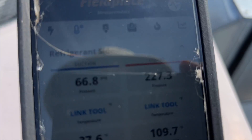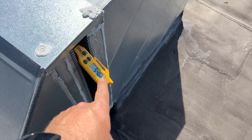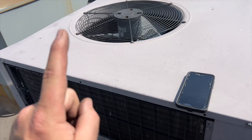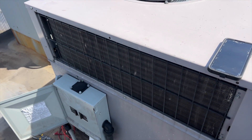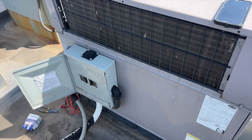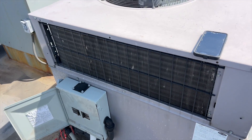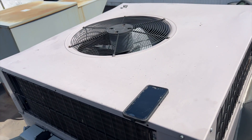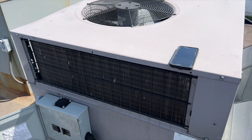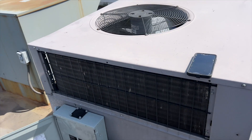She's been running for a little while — here's what our pressures are looking like. It's not freezing, so that's good. Discharge temperature is about 54 degrees, so it's definitely back up and running. I would like to do a more thorough coil clean and clean that blower assembly and wheel, but it is what it is. We've got new filters in and she's doing pretty good. I'm still not sure what caused the low-voltage breaker to trip — maybe the contactor had an intermittent problem, or maybe it arced really bad and caused an EM field which caused it to pop. I cycled everything and couldn't reproduce it. Checked for low-voltage shorts and found nothing — it's going to be a mystery.